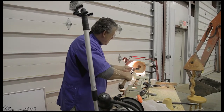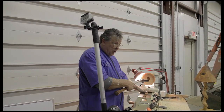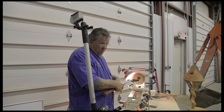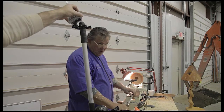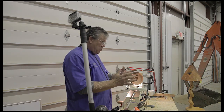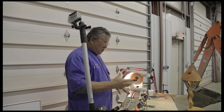And a hook tool, I don't know if any of you are familiar with the little dolls in Poland and Russia that all fit one inside the other. They're wood. They're called matryoshka, and they're made out of boxwood, or linden tree, and they're turned in mass quantities. Believe it or not, the only thing that holds that wood on their lathe in Russia is a very large block of steel on the headstock with a hole drilled in it about that big around, and they turn the wood blanks and they hammer it in there with a big sledgehammer. It's called a cup chuck, and that's what they use for matryoshkas. It's just held by friction.